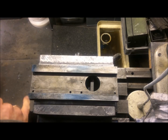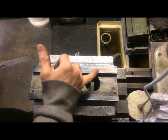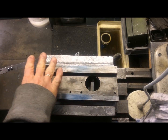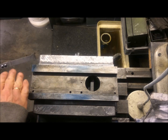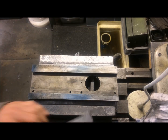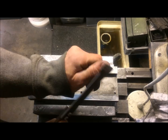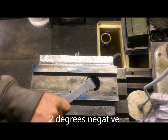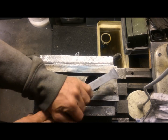What I will do here is begin by taking the blue areas just once, and then do the complete area, crossing those marks. I ground the blade flat — almost flat, just a couple of degrees — and I am pushing down with both hands.